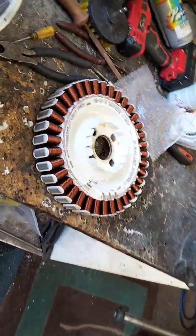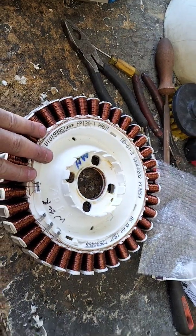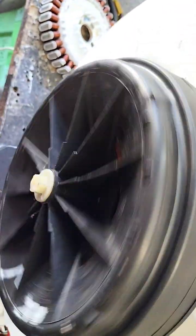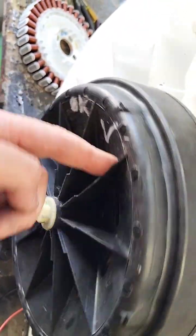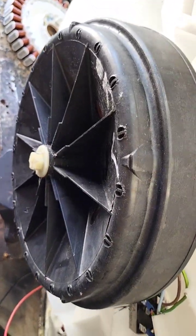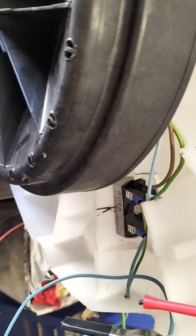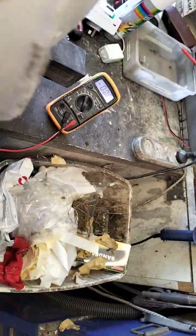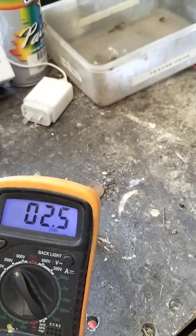So what we'll end up with is instead of something that's a motor, we've now got a generator. The faster that spins, the more electricity it produces. But even if it only turns slowly — which is why I wound it into groups of six — I'll do another video on exactly how I broke it up. But basically at that speed, if it just spins nice and slowly, that's going to get you between 12 and 20 volts. The next thing we've got to figure out is what sort of amperage we're getting — I'll answer that in another video. But right now, all I was wondering is will it give us the voltage, and the answer is yes.